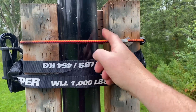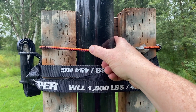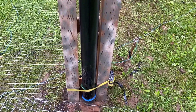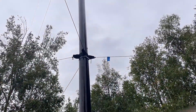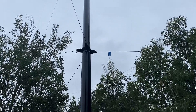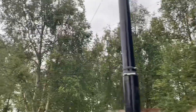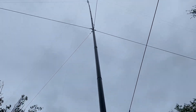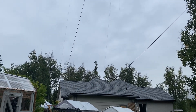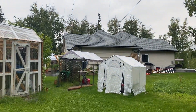Behind here is some rubber strapping to stop it bouncing against the side, and the same down the bottom. Then I installed guys — these are 1.5 millimeter dacron polyester or kevlar weave, two to five hundred pound breaking strain guy ropes — at three levels. At the top level is the top-hat capacity, with four 50-foot top-cap radials coming down, held up temporarily using fishing line — you don't want to put a lot of weight on the top of this aerial. That's stage one; I'll talk about the earth radial field and what the fencing wire on the ground is for in the next video.